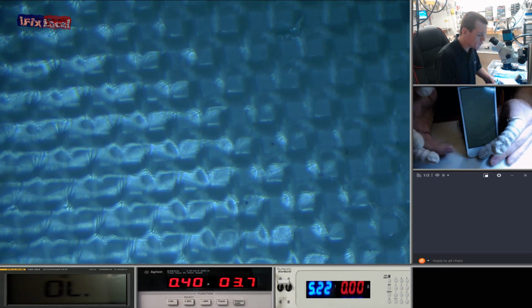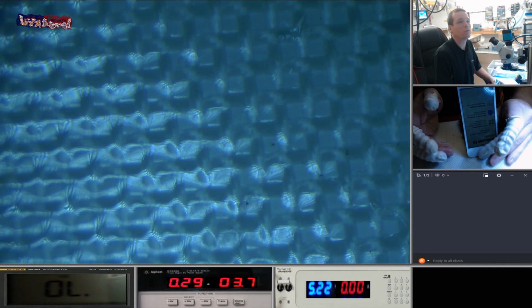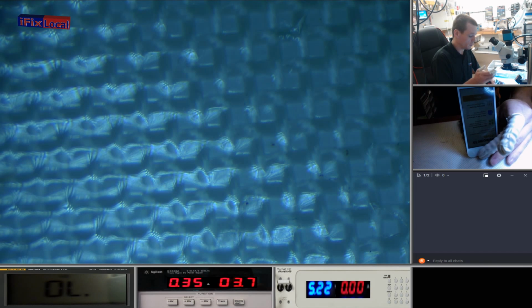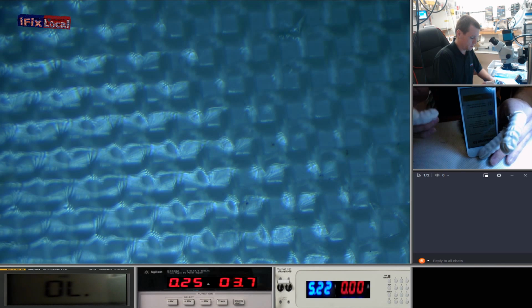Go into notes. Right. You can see we've got one working iPhone. So that one bad cap that we've just taken off the board there was stopping this phone from booting. What we're going to do is get this back for data recovery. We'll get all the shields back on. We'll see how functional the phone is. And after that, just let those ladies go.